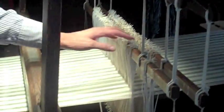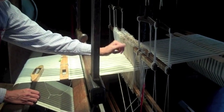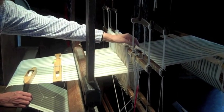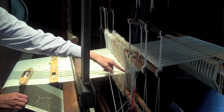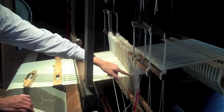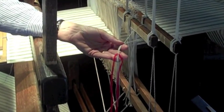It's like the pot holder. You're going to take your left and right thread and go over and under every one of the stretched front-to-back threads. Only, since I have so many and they're so tiny, we want to do this more efficiently. So we're going to divide our warp threads into two groups — the evens and the odds. And we're going to thread them through these string pieces that have eyelets, called heddles.